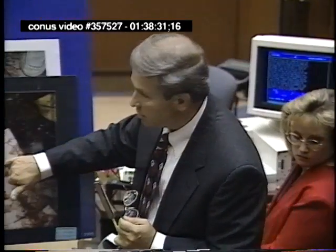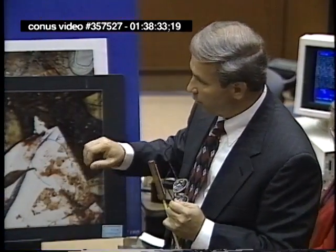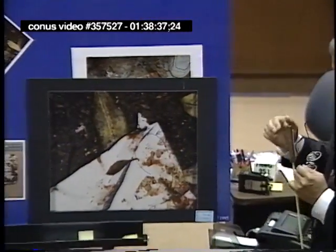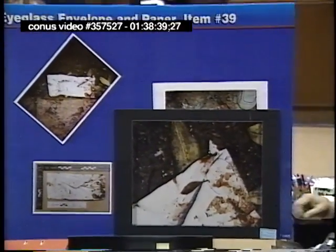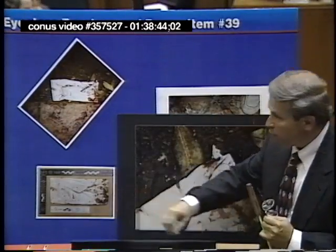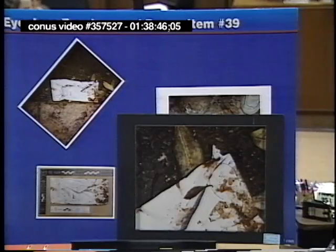So understanding those three ways that designs are implanted into molds, I don't see this as a shoe design. There are very fine patterns that may be this fine, but they will be of the texturing or stippling type or siping, but not of a pre-molded, routed out type, where they would be parallel.